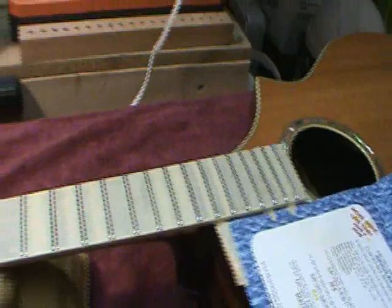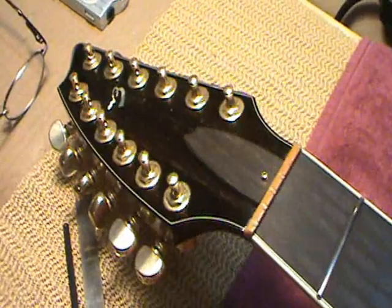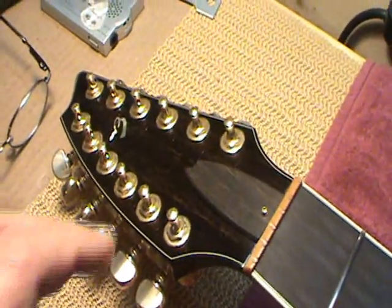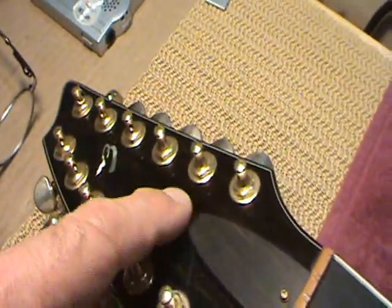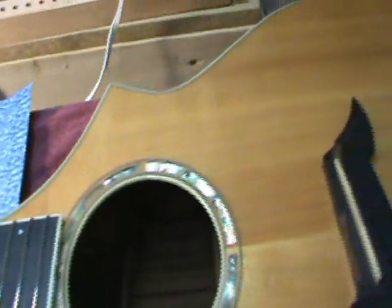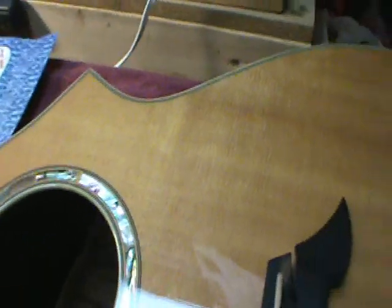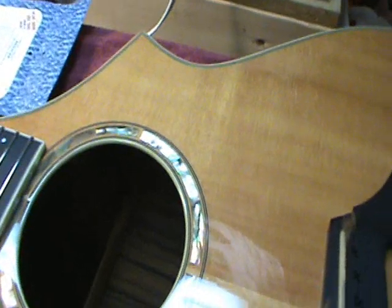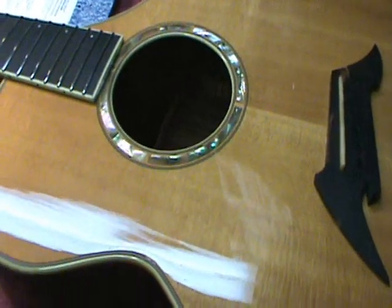So I'll take the tape off here and get ready to polish it. Alright, going to polish this up. Being obsessive compulsive as I am, there's this little scratch down here on the headstock. I think I'll get some of that fine polishing compound, take that out, and then there's no pick guard on here. If you catch the light just right, it's got a bunch of pick scratches in here, and I think I can get those out too with that fine compound. I'll do the fine, and then I have a cleaner, and then there's a plastic polish, so it'll really bring the sheen up.